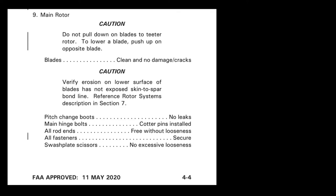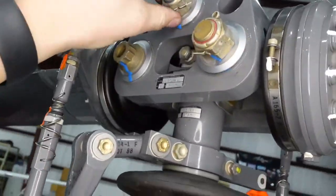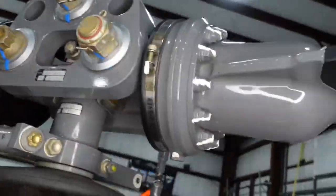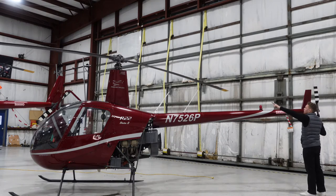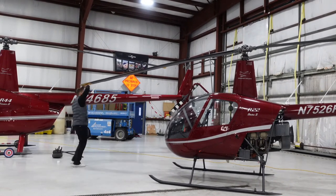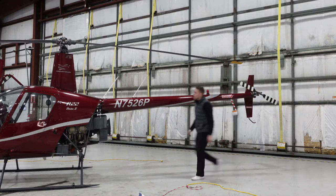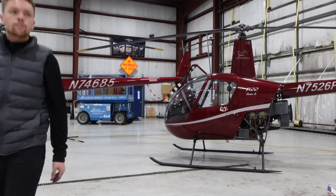Here's what we check on the main rotor — never pull the blades down. We're going to check the pitch change boots, the main hinge bolts, all rod ends, all fasteners, and the swash plate scissors. Checking the boot, the main hinge bolts, cotter pins, torque stripes, pitch links, all the blade grip bolts, and the swash plate scissors — making sure those are all tight. I'm literally checking every bolt, making sure it's all tight. To rotate the blades, I take the rotor brake off, being very careful to watch the blades and spin them from the tail rotor in the direction they're meant to go. To check the other side, push up to tip the blades down — never pull them down, push up to tip it down. Check the blades, rotate again from the tail rotor, making sure it doesn't hit anything. Check the leading edge of the blade — that's how we check the blades.